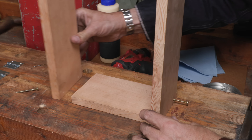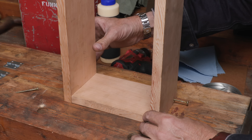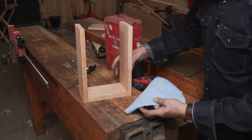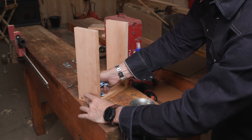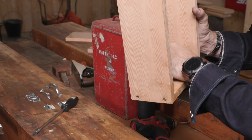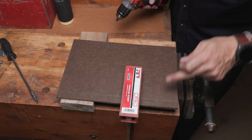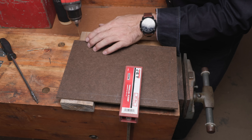We'll put a little glue on here for our final assembly. Gluing a joint makes it very rigid — there's just really no downside to it. These are real high-quality exterior-grade deck screws. When you're working with glue, always have a little water on hand. The cleanup is easy now, very difficult later.